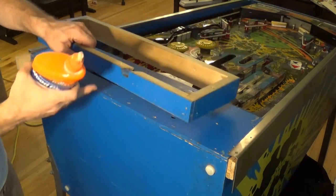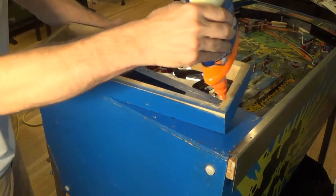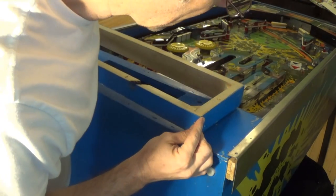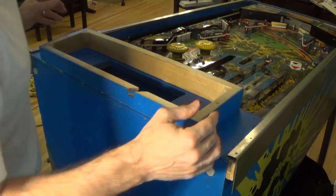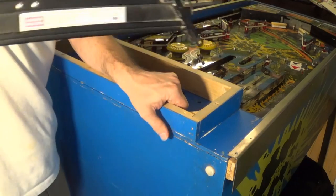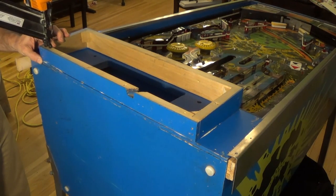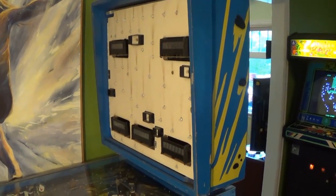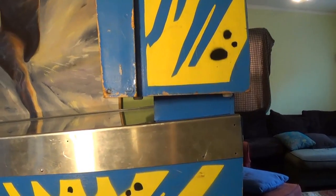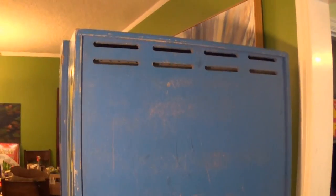And just like the plate, I'm going to glue the base on, and then I'm actually going to use 2.5 inch finishing nails so I can go through this piece of wood. Okay. Fit it as best I can to the original. And there you go, the back box head support is all fixed. It's securely sitting there, nice and sound. Here's the back, and it looks pretty good. Maybe some touches of paint, and nobody will notice that anything happened.